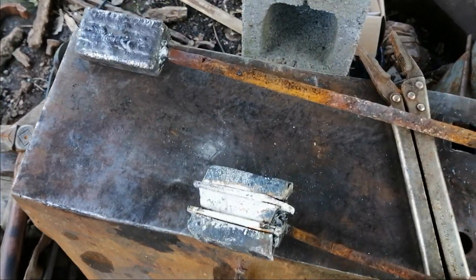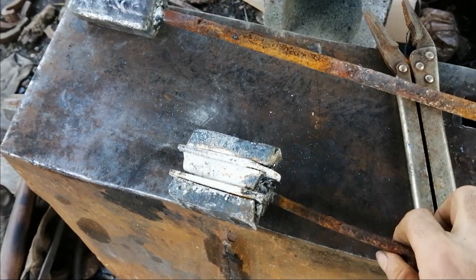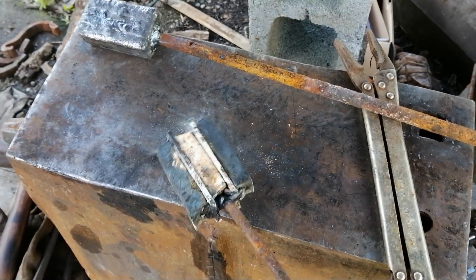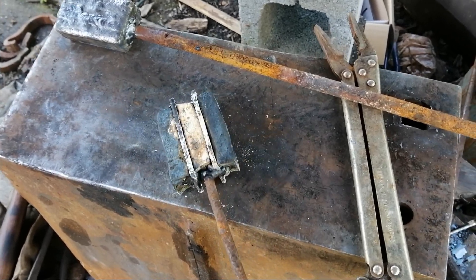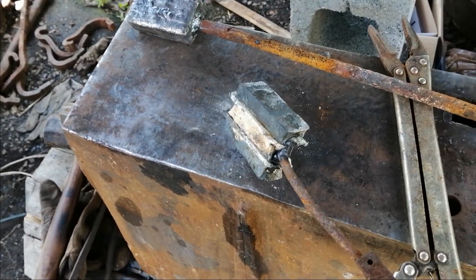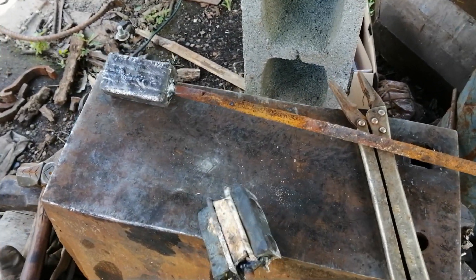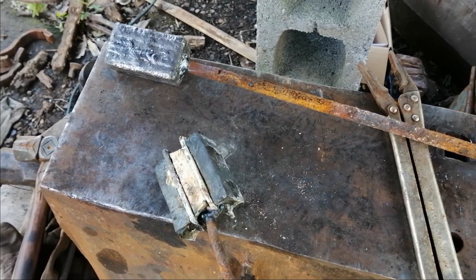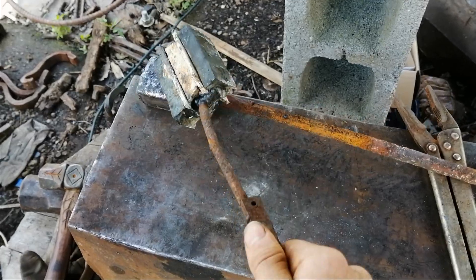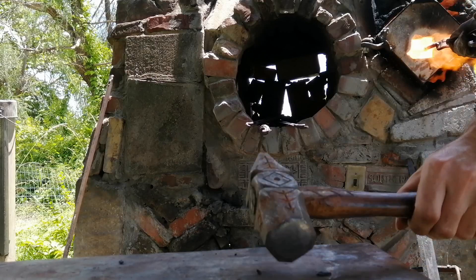Actually, I've changed my mind — I've decided this is a bad idea. I should really practice first. So I got this little billet, it's just some high carbon steel and some wrought iron I welded up months ago but never got around to drawing out and finishing. So I'm going to practice on that first — stick it in and see if I can weld it solid. If that goes okay, then I'll move on to the stainless steel piece.